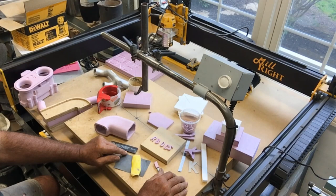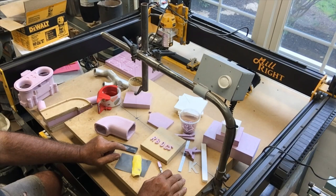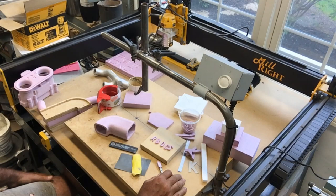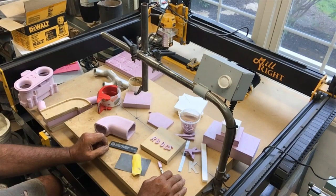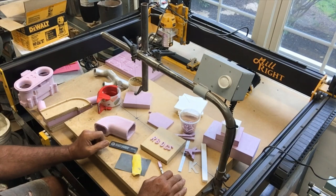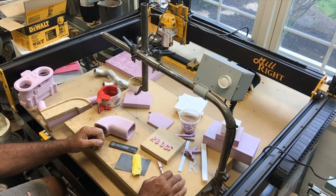A couple of last things about cutting and resizing foam. Once in a while I'll cut it on my bandsaw, which is all right, but it leaves a really rough edge. You've got to be careful about doing it on your table saw though, because that spinning blade will melt the foam and make it really grabby — you can get a lot of kickback. A hot wire is so much better than a table saw: no mess, and the worst that's going to happen is you'll brand a little line on yourself if you touch the wire. You're not going to hurt yourself on the hot wire at all, and you can do quite a bit with it.